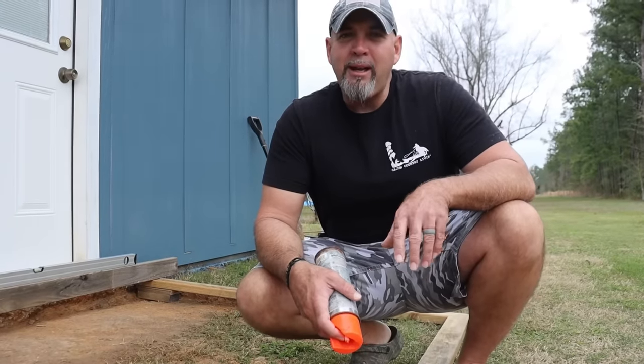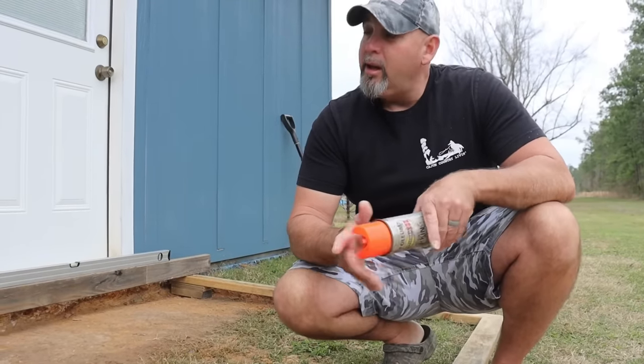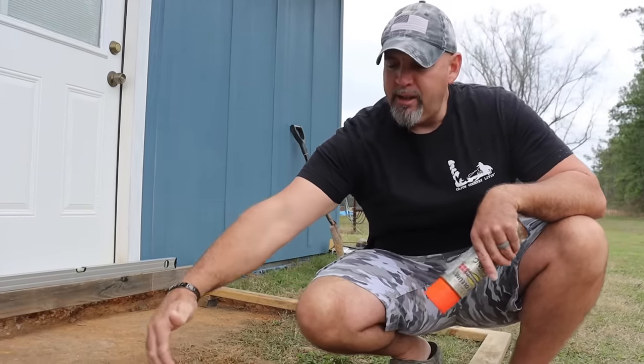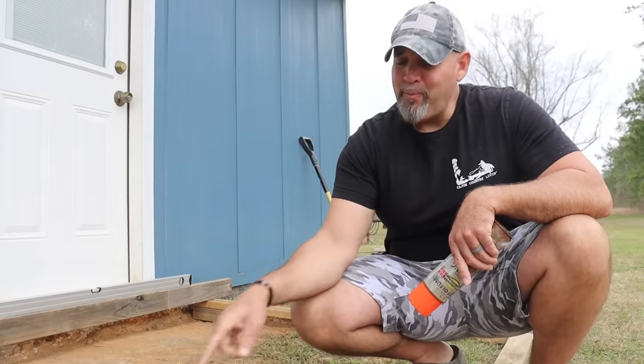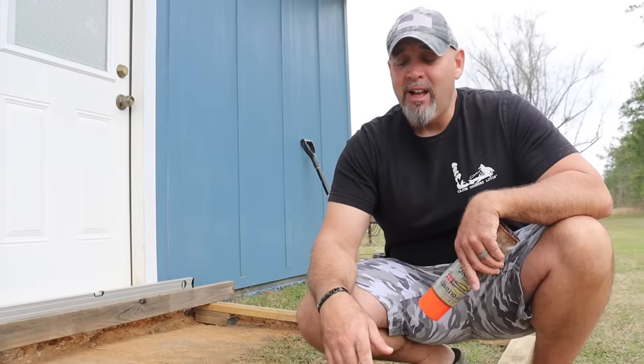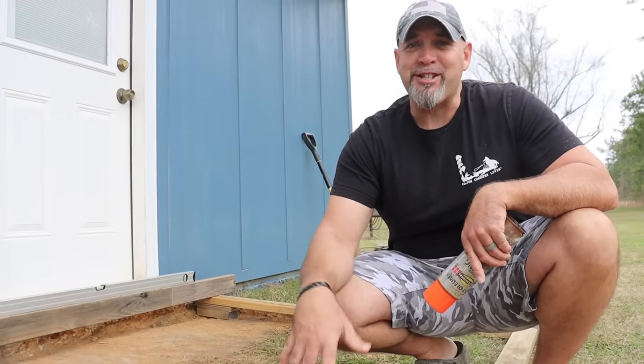So everywhere that I paint, I'm going to dig out a little bit, because with the water running off the house, we don't want it to undermine the side of this slab. And digging a little tiny chain wall all around the outside perimeter of this thing is just going to help keep that water from undermining the slab, and that's all we're after.